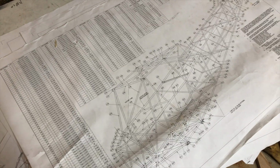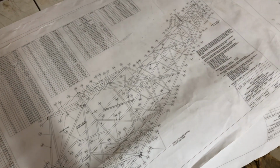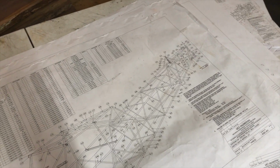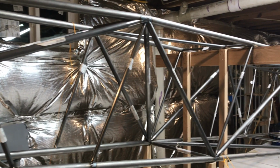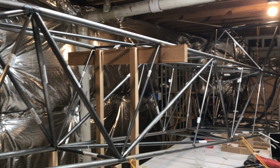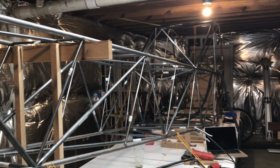I didn't scratch build the kit because the Cub fuselage wasn't designed to be built by a home builder. Like a Pitts fuselage or a Skybolt or I think a Bearhawk, you can build those flat on a table and stand up the sides, where on a Super Cub, the longerons have a few bends in them, and the sides just aren't built flat like they are on a homebuilt airplane that's designed to be built on a table by a home builder.